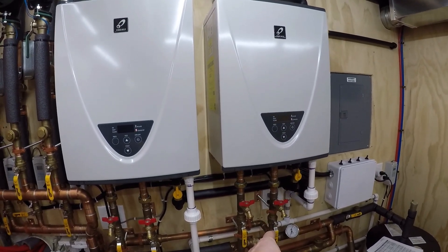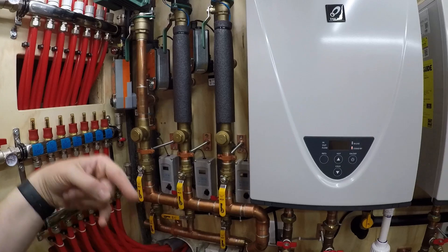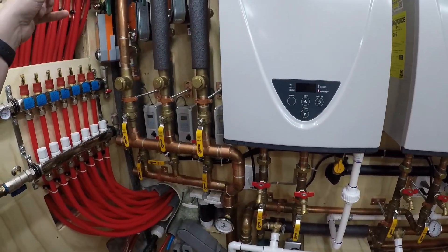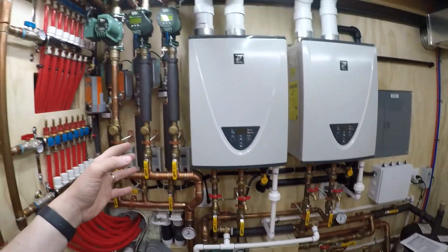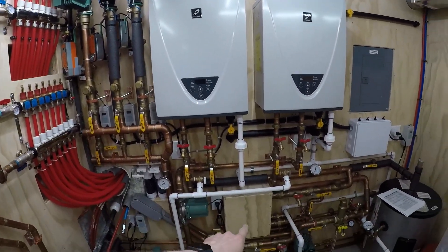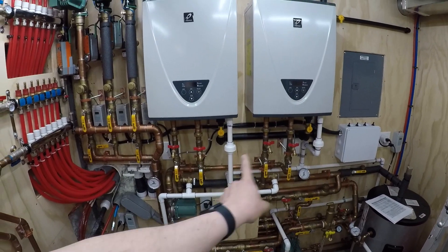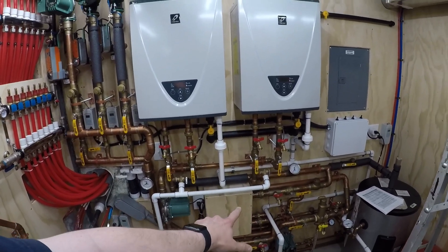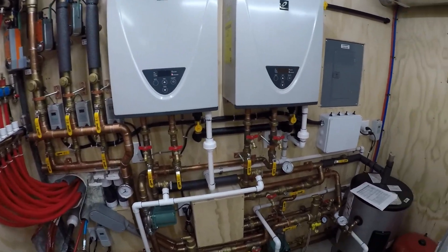What that's going to do is start circulating the glycol coming from the driveway across the heat exchanger and back out to the driveway to pick up more heat. Basically I'm running the system in reverse. Normally the glycol in the snow melt loop would be picking up heat from the heat exchanger because the heaters would be providing heat in the primary loop, so the secondary loop — the glycol in the snow melt — would be pulling heat from the heat exchanger and dumping it into the driveway. I want to see if that'll work in reverse.